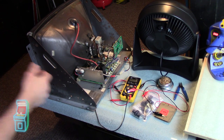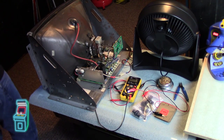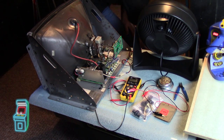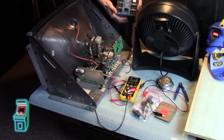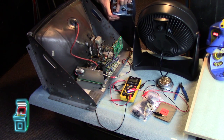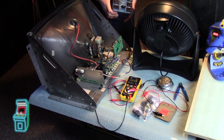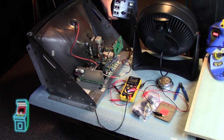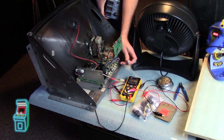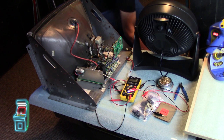The first thing I'm going to do - I have it plugged in but not turned on. I'm actually running this with an extension to my OutRun machine. I have an isolation transformer - an ISO tap - that I got a while ago and forgot about. This allows you to plug things into it and select what voltage you want - 120 for most things, or 100 for Nintendo ones. I still need to build an adapter by soldering in the plug connector, and then I can just leave this on the workstation.